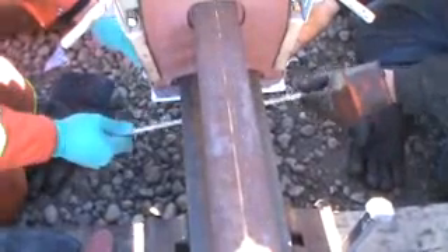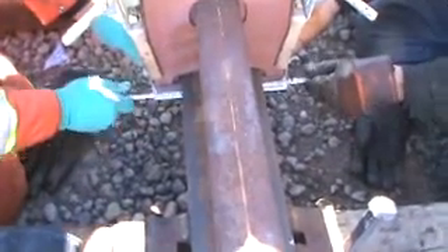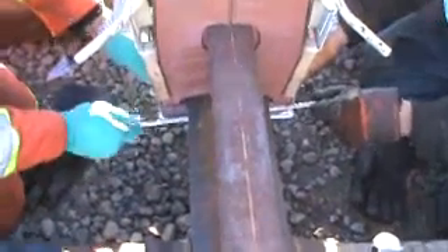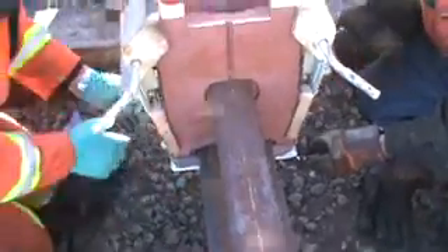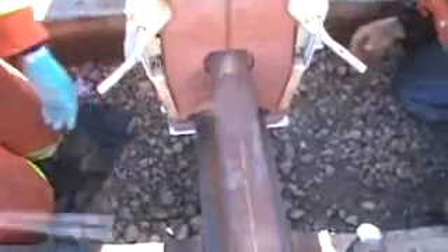Where's that rod? So that's the rod — you grab it with the other hand and put your other hand on this side to feel as the base plate goes. We come under the base flush, and we're just rocking back and forth, then we go under. Under the top. If it's really wet paste, when you take that off, roll it out so you don't pull the base away. Now, that's the time. You see, we've got a little gap here. That's all right — the little gap will be filled with paste.